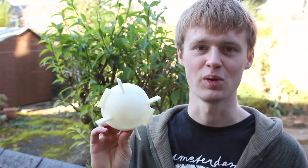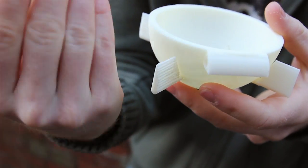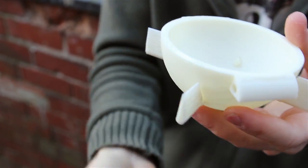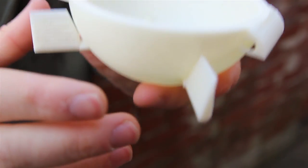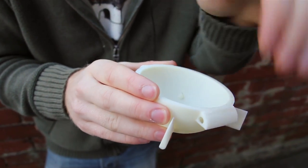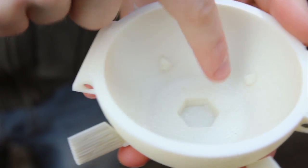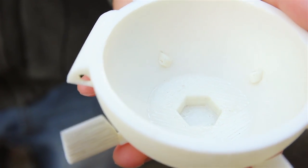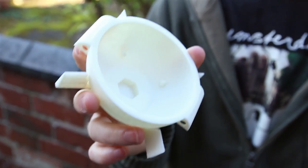This is the result of what was printed the other day. We've got these wings, so they'll be tilting about 10 degrees, which when the air's coming in will push it around, adjusting the vertical position — whether it's up or down. None of these will be fixed on the actual design. They will retract and come in like this. At the moment it's fully down with full drag, but when it retracts it will be able to fall as fast as it can. That's basically the ballast — the heaviest bit will be at the bottom so it falls more stable. We've got space to put in nuts and bolts to adjust the centre of mass.